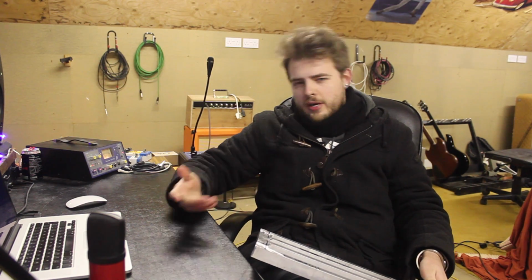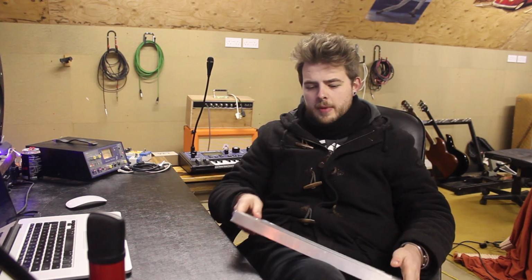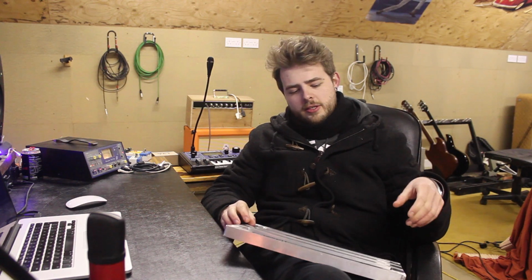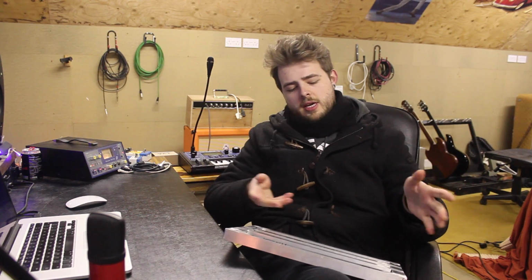Just to give you all the information I can about the process, I was doing TIG welding, which is essentially a welding gun with a filament inside it that is controlled by a pedal. You control the heat on a pedal, and then if necessary you have another piece of aluminium filler rod that you can feed in as and when necessary.